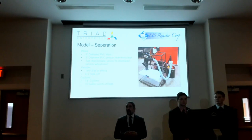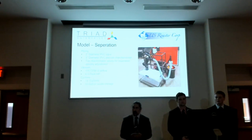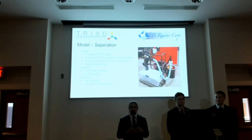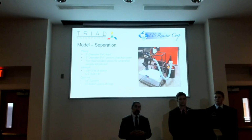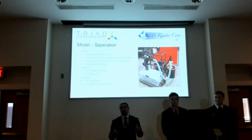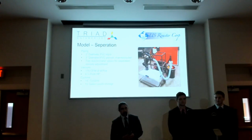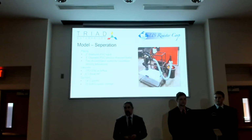We have a cyclone separator to help separate the dust out to keep it from clogging up the vacuum. We used PVC pipes for our routing, and we have 2 discriminator valves involved to fine-tune the amount of suction force that the beans see as they're processing through to help sort the chaff from the nib and improve the efficiency that the bean to bar producer may see.